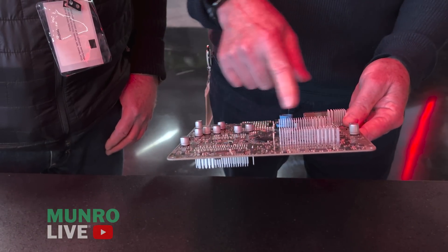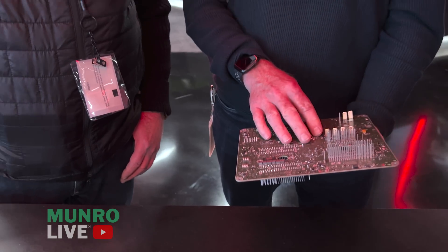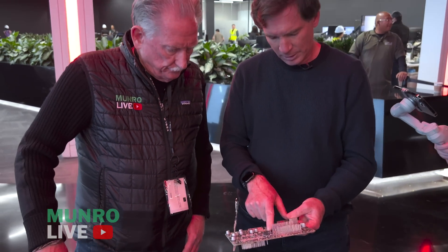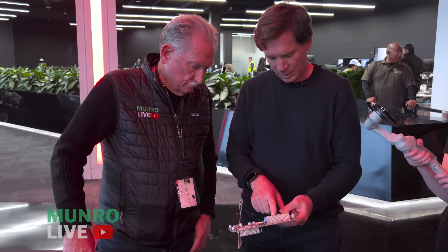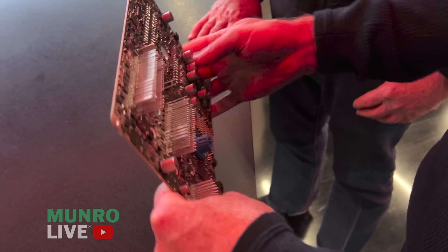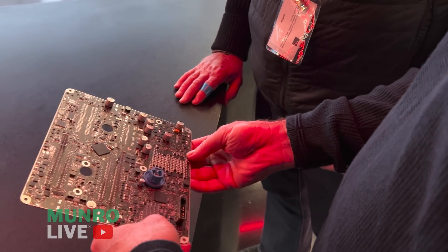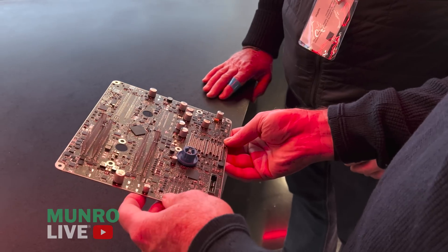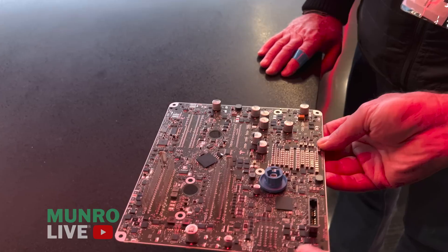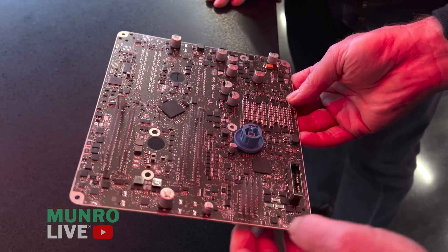The problem we're facing now is that the board is dominated by the connectors. If we could get rid of or densify all these connectors, that would be a lot nicer. We've been using this style of connector for quite a while — we're just pin-stitching on the module, and the connector itself is formed into the cover. So when you see it in the car, the cover on top forms the body that the connector actually connects to. We don't really buy connectors — the shield is already integrated in there.